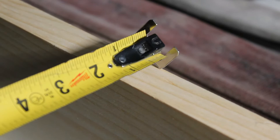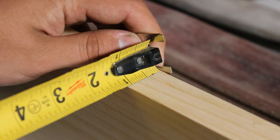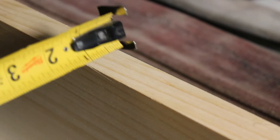For a fire hose flag, we're going to need a backer and a border. I'm choosing to use half-inch plywood for the backer and five-quarter pine for the border to strengthen the whole thing. I'm going to put a dado or rabbet in the back so I can inlay the backer into the pine border. I'll do about three-quarters of an inch extra length on the plywood all around so it fits nicely into the border and still leaves enough room in the center for the hose.